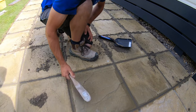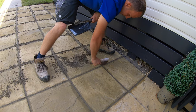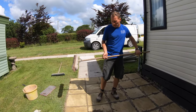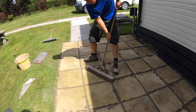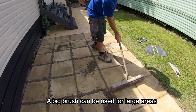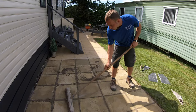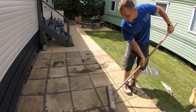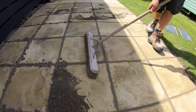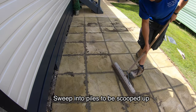Go around the whole patio brushing it off like that and she's ready to go. Just brush it into little piles in the middle of a slab and you can scoop them up. If you've got a large area, you can use a nice big sweeping brush — again it's got to be nice and soft. With a big brush you can work over some areas quickly. Make sure it's soft and you're not leaving anything in the joints, and make sure you're not dragging it over the joints. If it's dry enough it won't do that. Get any dusty bits out of the joints like so.